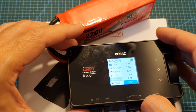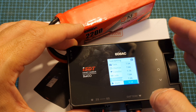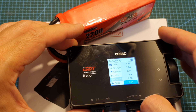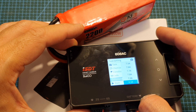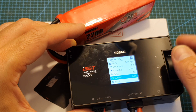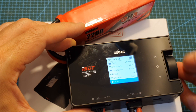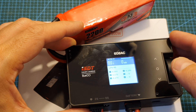Keep in mind that when connected via AC the maximum charge power is only 50 watts, which means that for a 4S battery the maximum current is going to be around 3 amperes. After selecting your desired settings you can hit start and the battery will begin charging.